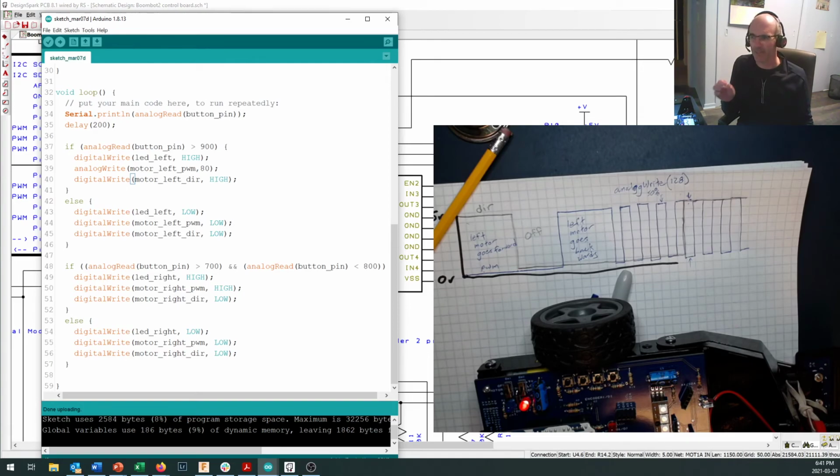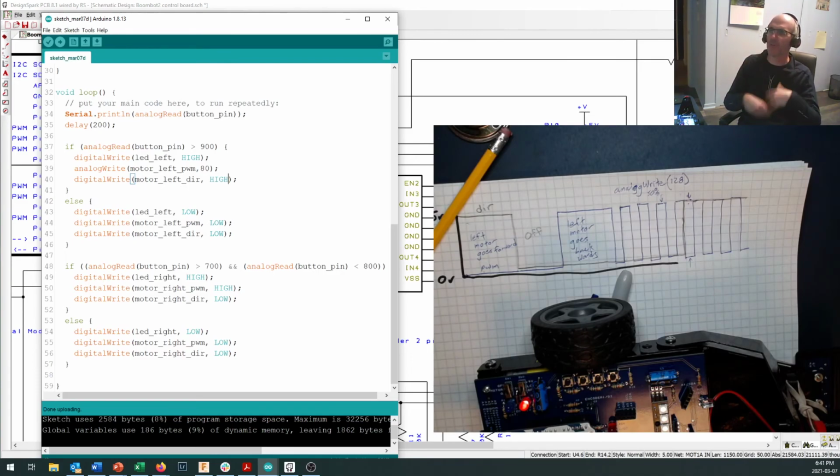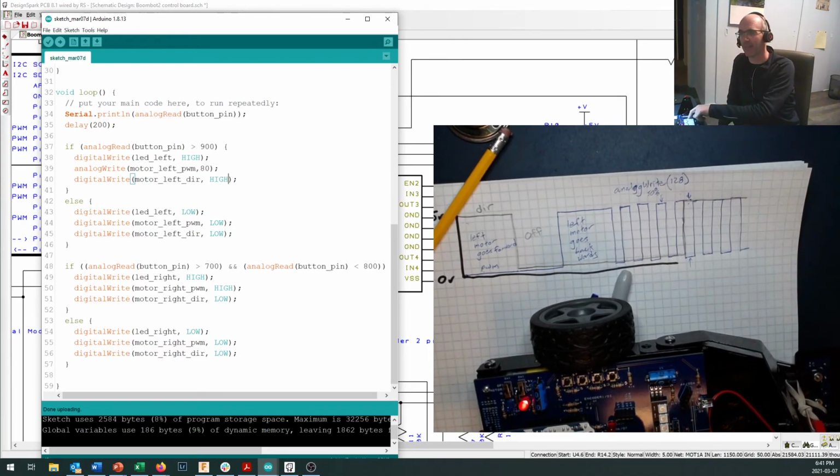This is just like your tethered mini sumo robot. If you turn the H-bridge on and put high voltage here and low voltage there, the motor spins in one direction. If you put high voltage here and low voltage there, the motor spins in the other direction. You reverse the direction of flow through the motor, you reverse the direction that the motor spins. On our mini sumos, you did it by pushing switches. On here, you do it by pushing digital switches and controlling a chip. It's the very same thing. But these ones we can press really, really fast, and we get this neat little pattern in here, and I'll let you ponder what's going on there and figure that out.